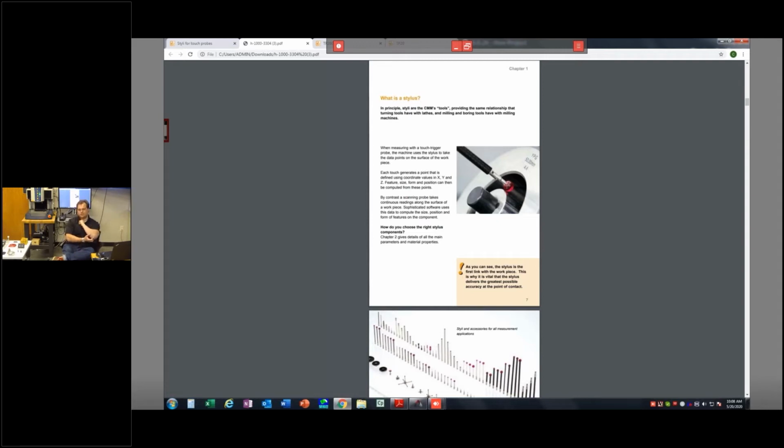But just as a preface of what I hope to accomplish today, I want to talk about building probes in ICE. So what do I need to do in order to actually configure a touch probe? Then configuring a cal sphere, okay? And then also configuring or calibrating touch probes, both star probes and regular negative 90-degree probes. And then also, how do we use them? Some basic methodology for creating CAD-based measurements in Zone 3 with touch probes. Okay, so without further ado, let's get going.